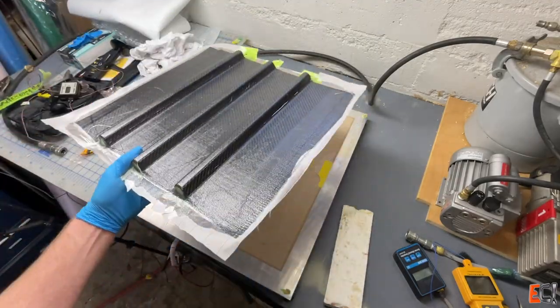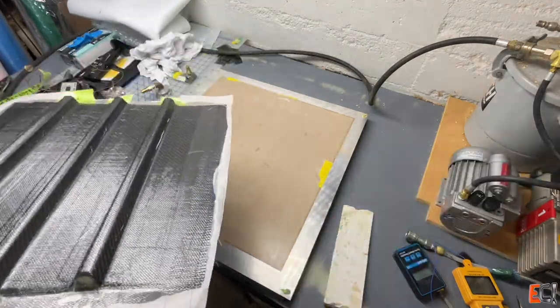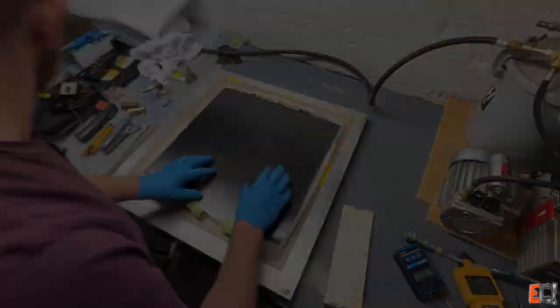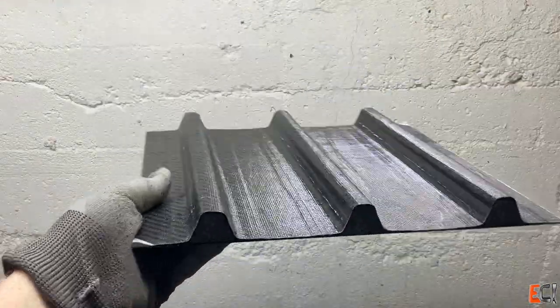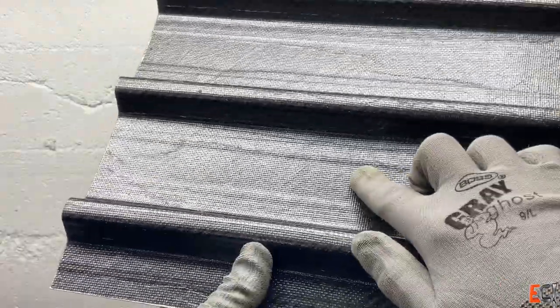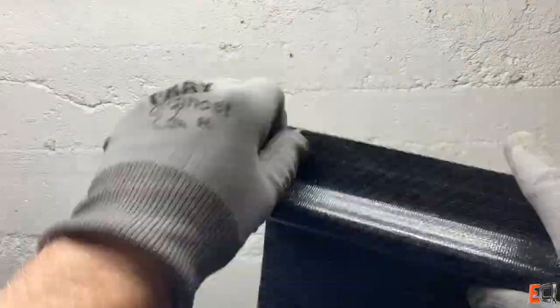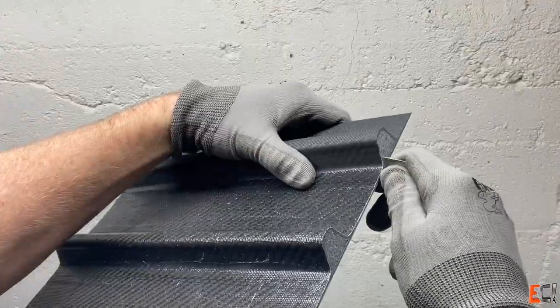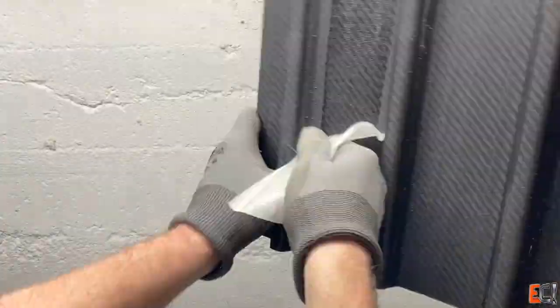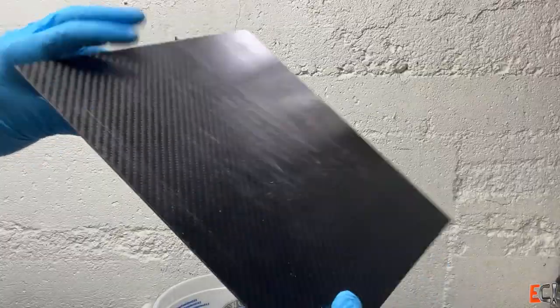You can see the laps showing through there, where the extras built up over the stringers. And it turned out pretty flat once I trimmed it up. It's a little bit of carbon dust in the end of that Rohacell, but you can see the laps there with that biax over the top. And peeling off this peel ply. Not perfect, but it lines up okay, the twill.